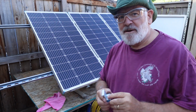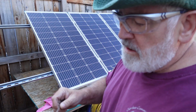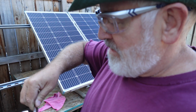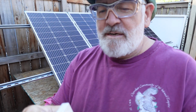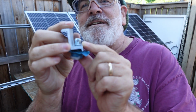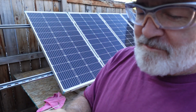Now the end clamps, they're set up a little bit different. You see, let's grab that wrench. They've got like a little lip on the end here. I'll show you that. You see, the middle clamps, when they come down, they can bite nice and even and pull the panels all the way down to the frame and secure it. On the ends, it wants to rock like that if you don't have this little tab here, and that'll force it down like that. Kind of a little physics lesson, I guess, leverage and whatnot, but it makes it nice so that we can slide them in.